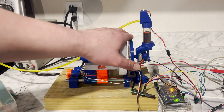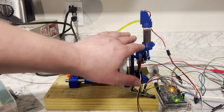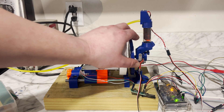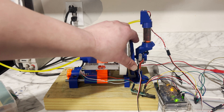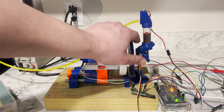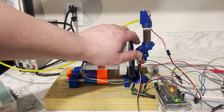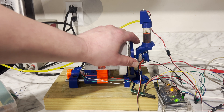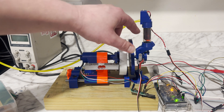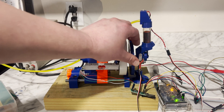Something that's been on my mind a lot: what is the most efficient way to fill the cylinder with air? Is it to wait until the cylinder is at the top, just coming down, dump a little bit of air in and let it expand? Or is it to start filling the cylinder as soon as the piston hits top dead center and keep filling it until it opens the exhaust valve? I think the most efficient way is to dump all the compressed air in when the piston's just leaving top dead center, then shut the air off and let it expand.